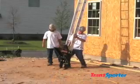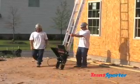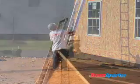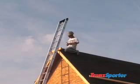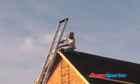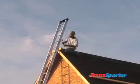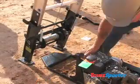Move the bottom of the hoist base unit away from the building 1/4 of the height of the building where the top of the hoist is supported. Secure track sections to the roof with a rope or alternative method. Do not tie rope to rails or use a method that prevents the carriage assembly from operating properly.